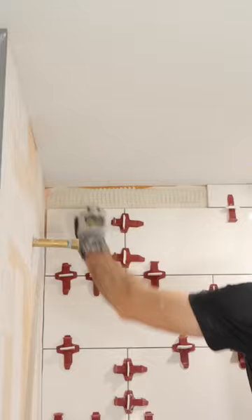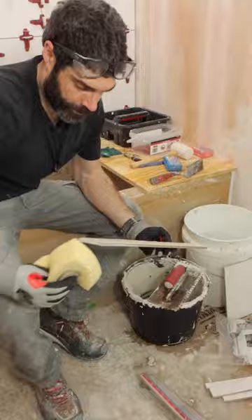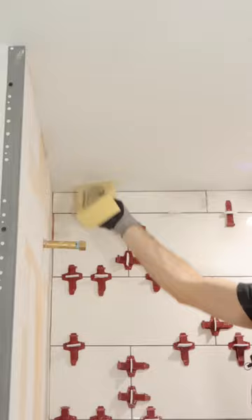I then added clips on two sides, back flat troweled the tile, cleaned off any excess thinset, set the tile, and tapped it in place with a rubber mallet. I cleaned any thinset off the wall and added wedges to make sure the tile was aligned and had even grout joints. I hope these tips help you out.